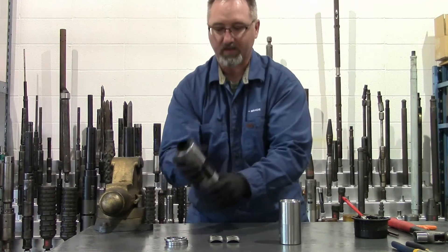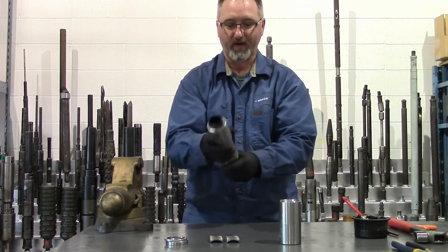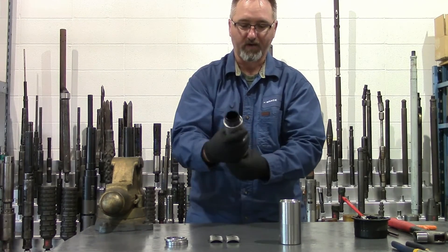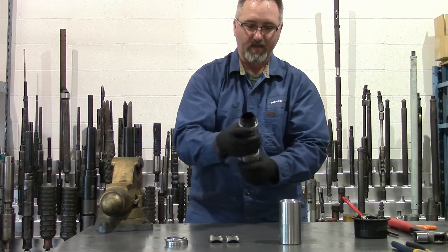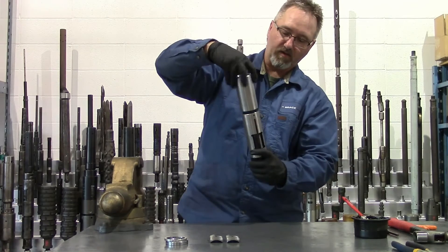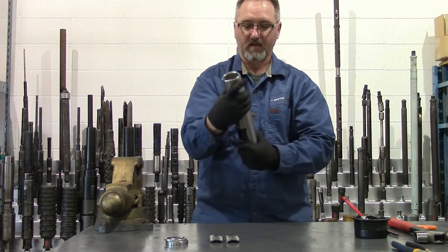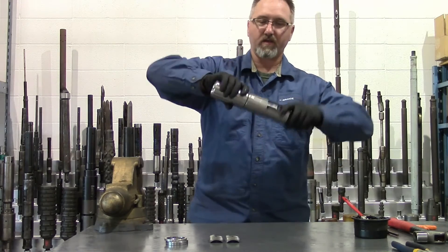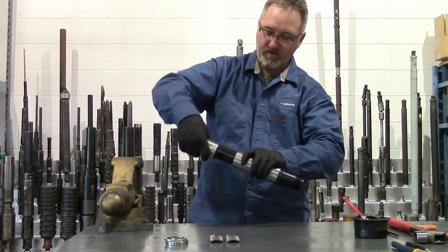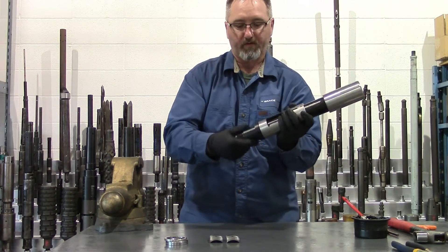You can use the ingenuity to get that all started by threading your packing mandrel into there — you don't have to do a bunch of hammering and whatnot. Slide that on so your threads are exposed on your expander sleeve, and then install your fish neck onto your expander sleeve. Then you can pull your expander sleeve to the open position, thread your fish neck on the rest of the way, and remove your packing mandrel.